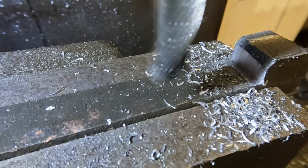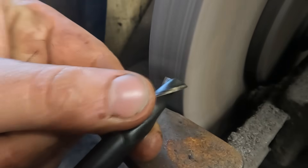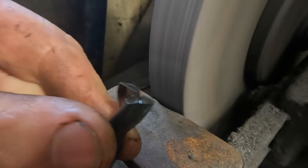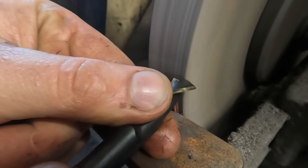This tough steel was starting to take its toll on my slot drill, so I gave it a fresh edge on the grindstone. This works well as long as you have a nice true fine stone and pay close attention to the squareness and flatness of the cutting edges.